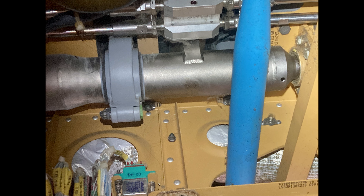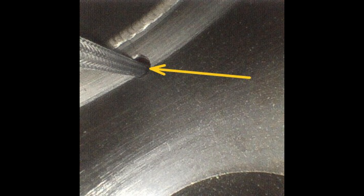Go ahead and grab your borescope, stick it in that hole, and look around. Here's the video I shot while looking around inside this one — it doesn't have corrosion, it's got some dust, and I'll show you where the dust is. There's a part of the video where the tip of the borescope is articulated looking back on itself, so that's the hole the borescope tube is going through.